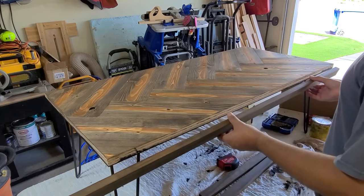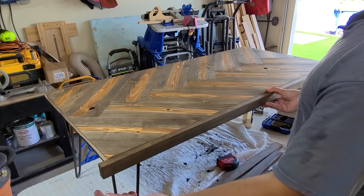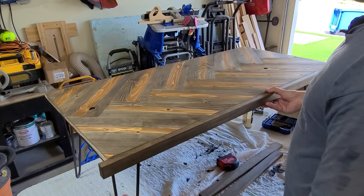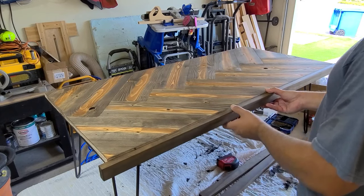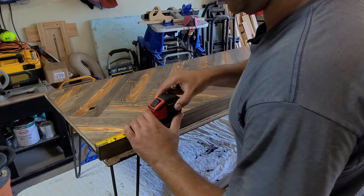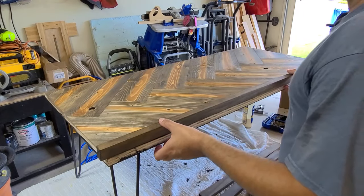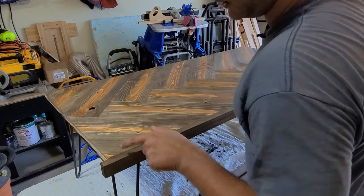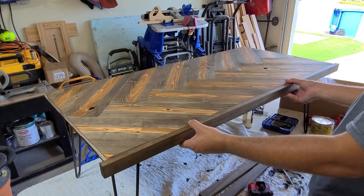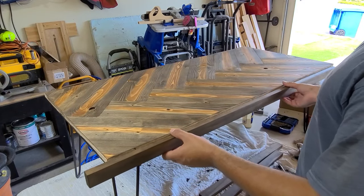For the trim, remember we had a three quarter inch overhang on each side, so the inner trim piece will butt up. All you have to do is cut the inner trim piece to whatever the width was — 24 inches in this case — or you can do 45 degree miters, which will look a little bit nicer. To set this up, get your tape measure, measure in three quarters of an inch, and put a little line with a pencil. When you go to put the trim on, all you have to do is line the edge up with your three quarter inch pencil line, then glue it and shoot it in place. I'm going to go around the table and I'll get back to you when I'm done.